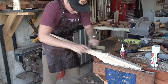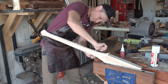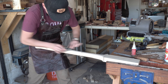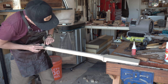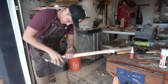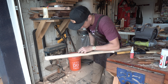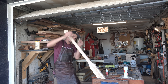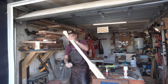Then I'm on to a flat bottom spokeshave, and then here's just a really sharp small Stanley block plane, and then my Diablo sandblock with sand net, and then finally a card scraper. I tend to like to push my card scrapers on flat workbench-height surfaces, but in this instance it just felt more comfortable and was way more effective on the pole.